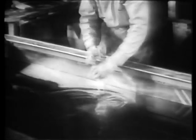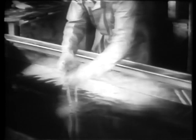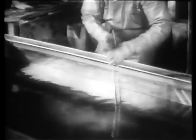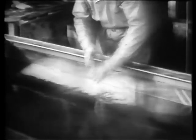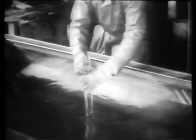A study of the hardening of steel shows that steel can be hardened by heating and quenching. Hardness, however, is only one of the useful properties of steel. Toughness, for example, is frequently essential. But fully hardened steel is not tough. On the contrary, it is usually brittle.